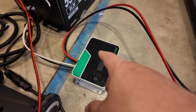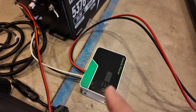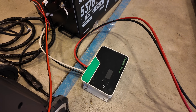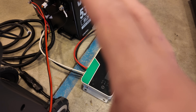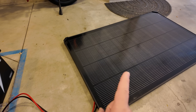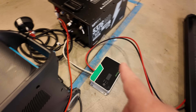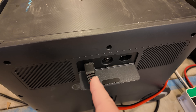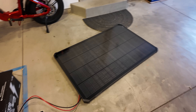You can use it to charge a 48 volt battery like we're showing here, or recharge your 12 volt house batteries if needed. It's compatible with lithium, which we're doing today. If you need to top off your starter battery, it also has a lead acid mode — it's very versatile. One of these can accept up to 150 volts of DC input, so you can hook more solar panels in series to this than you could to the power station. And this is a 40 amp MPPT solar charge controller, whereas the power station's is only 20 amp.